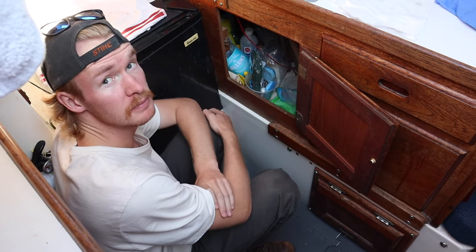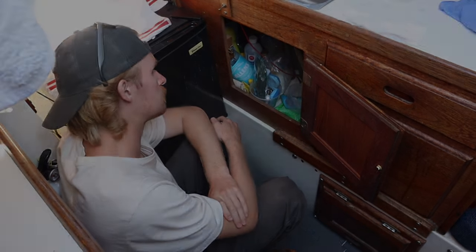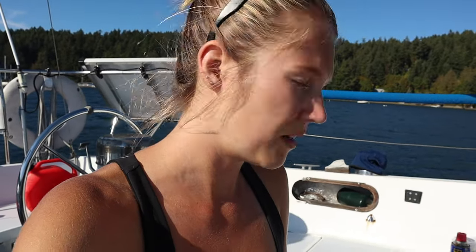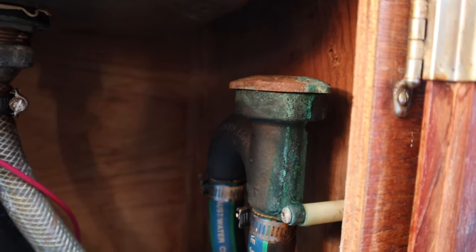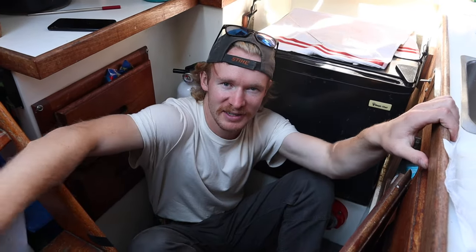How's it looking? I don't see anything. We'll let it run for about 15 minutes. The engine has been running for 15 to 20 minutes, which feels like a good amount of time — water's moving through. We've been checking the loop periodically and there's no water that we can see, which is huge because previously we could actually see water coming down. It feels dry and it looks great. Now Jonas is going to keep an eye on the loop while I shut off the engine, just to make sure everything is normal and we don't see any water — basically making sure it's fine at shutoff, because that's when siphoning could happen. Nothing has happened. It looks good — it's not leaking like it was before, so hopefully that's a result of the mild cleaning we gave it.